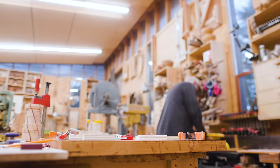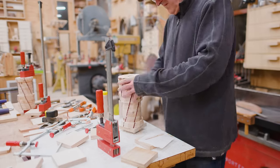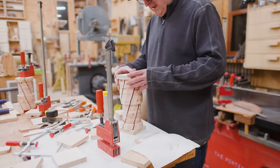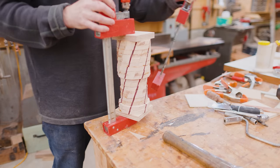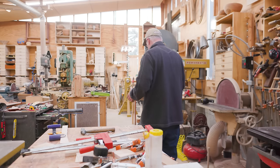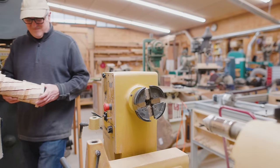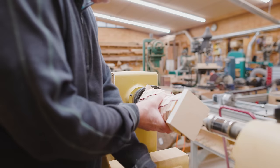Then I had the whole stack together and I glued a piece of plywood on each end. This gives me something to hold on to with the lathe — I can have a piece to drill a hole into for the tailstock and I can hold on to the square with a chuck on the drive side of the lathe. It was feeling like it was going together well and the pattern was working out. I had two of these at this point — one that turned in one direction and one that turned in the other direction.